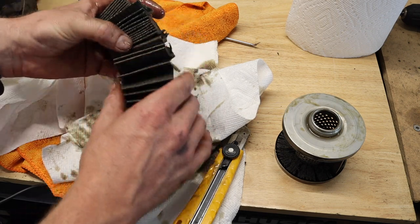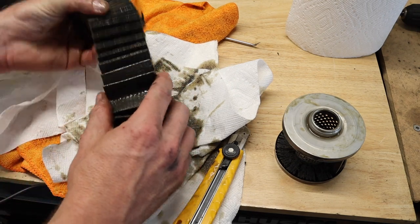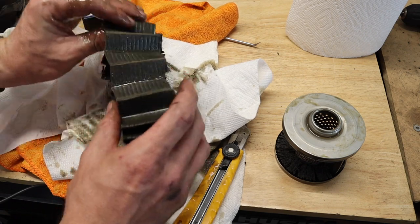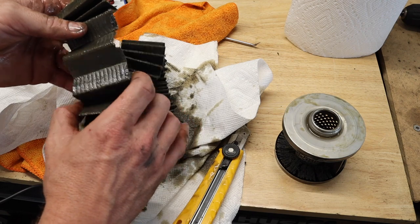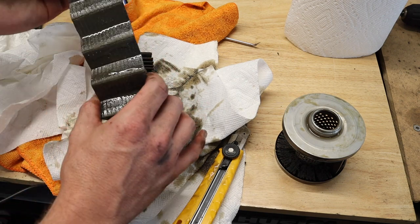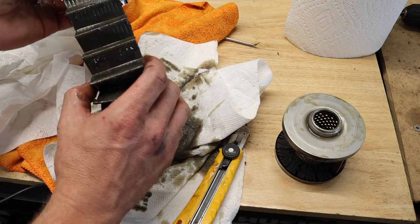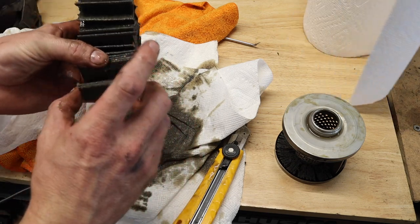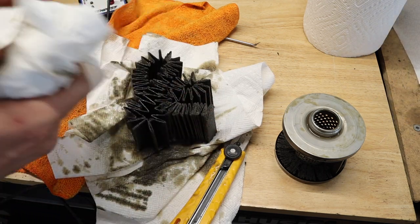If there's like a little speck here or there, that's normal — the engine is running and it's going to look like little pieces of glitter every now and then, and that's not a big deal. But I opened up our old Bonanza engine one time — it didn't have an oil filter, it had an oil screen — and I opened that up and it was just a big ball of metal shavings. Instantly I knew we had an issue. There are different types of metal in the airplane it could be producing: aluminum, brass, or steel. All of this looks really good — it gives everybody a sigh of relief even on a new engine. The engine's not producing metal, it's running good, everything looks good. You should be able to put the new oil filter on, fill it up full of oil, and be good to go. That's pretty much what you're doing when you cut open a filter and what you're looking for.